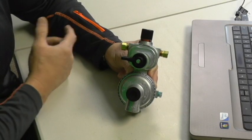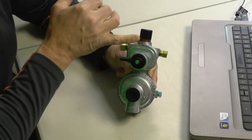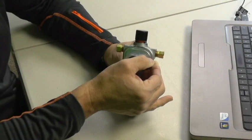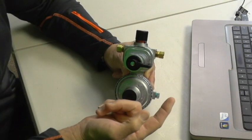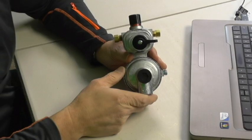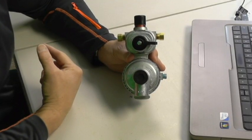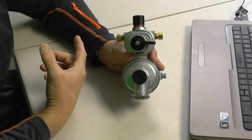When it turns red, it's feeding at about 80% capacity. In the middle of the night when the furnace is the only thing running, that's not a problem. But if you're trying to do some cooking, you might notice the flame isn't that high. So you go out, check your bottle, see this item has turned red, then you get this lever, push it over that way, and now it should turn green and you'll be feeding off the other side. You can also detach the empty bottle and take it to get refilled.